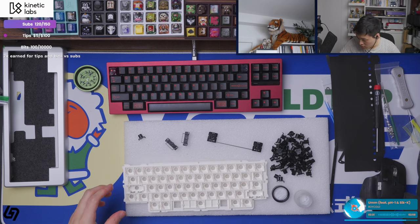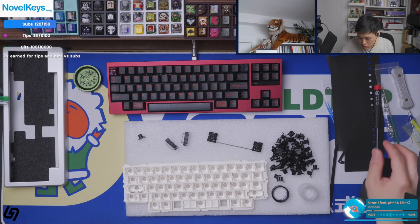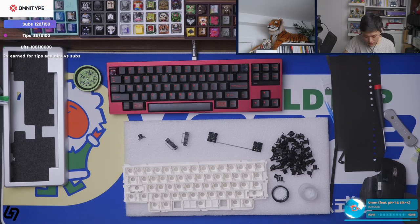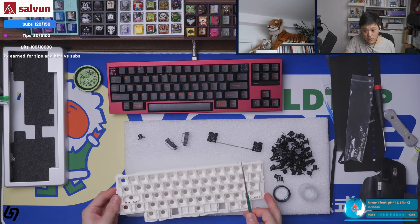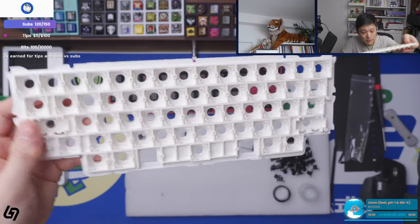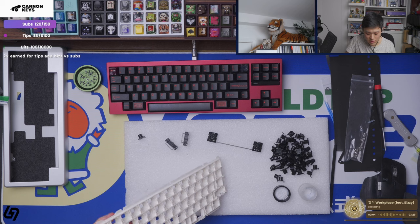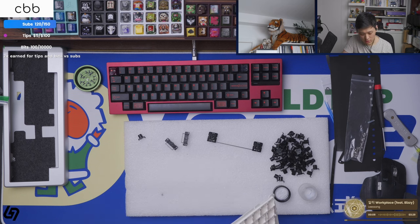You can go ahead and install the stabilizers, but before I do that, I'm going to check my slider openings for the Heavy Grail plate. Because this plate is made out of plastic, in the manufacturing process it is possible that you'll encounter some flashing of the plastic, which is bits of plastic stuck at the ends that didn't come off from the molding, right?